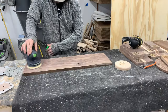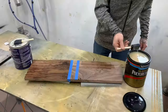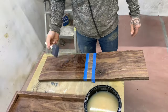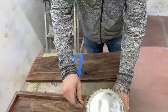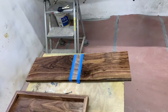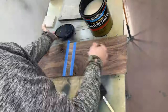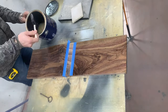Let's start out with how I finished the pieces. I started out by sanding them to 150 grit and removed all dust before proceeding. I typically spray all my finishes since we do such large quantities of items, but for this I'm just brushing it on, assuming that's what most people will do. It was a lot easier to just brush these coats on than switching over my gun with multiple different top coats. I followed the directions exactly as they were on the can, sanding between coats with 220 grit and removing all dust before applying the next coat. I applied three coats total.